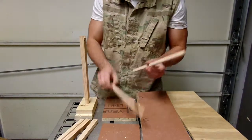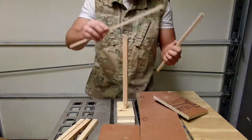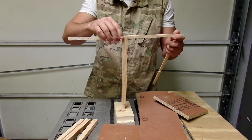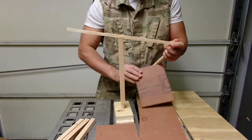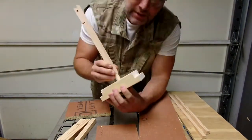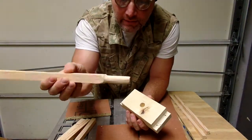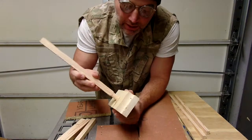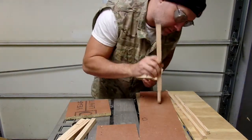These two pieces are part of your trigger system to build a little mast, and I'll show you how this goes together. This is going to be a trigger, and when the animal knocks it loose, the weight of the door — this is the door — is going to drop. So this is just part of the trigger system. This mast I've set on top and tacked down, and I've slivered off enough where this can just go in the hole. This makes the trap easier to take down. You can also just drill a hole in the top of your trap, but I wanted it to be a little taller so I made this little extra piece — unnecessary, you just drill a hole right in there.